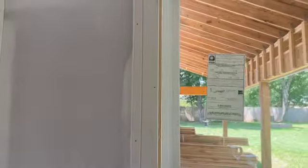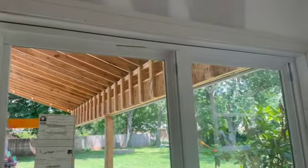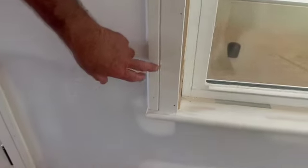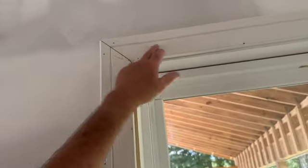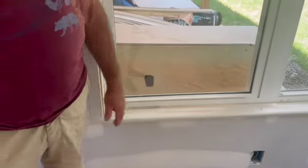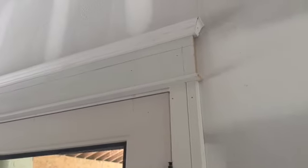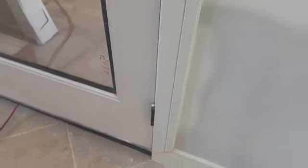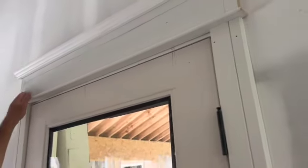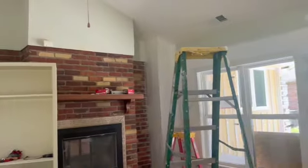Let's look at the window and explain your pattern here. Well, the dumbass that married my wife taught her too much about trim work and fancy work, so we ended up with a V-groove trim. I've set this up where it actually turns the corners, and when I get the aprons on they'll go straight down and then turn 90 degrees. The base trim matches up with the door casing. This is a head detail we came up with, but my wife decided we're going to run a V-groove across here and back down to match the rest of the trim — I'll have to do that with a router. You're causing excess work for yourself; you'll have to go up on your labor charge.